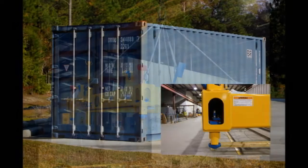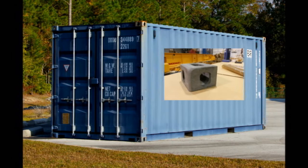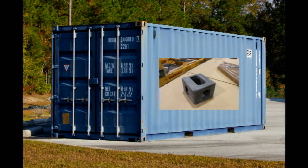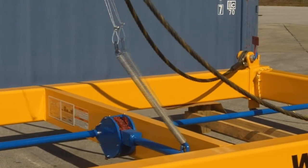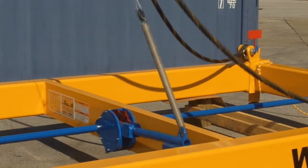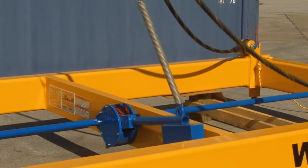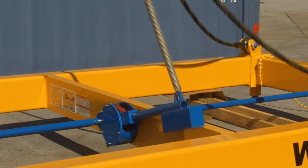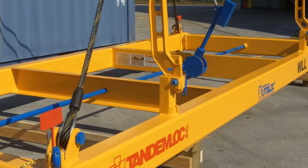In each of the four corners of the frame are twist-lock bayonets. The bayonets are designed to fit into the corner fittings as you can see at the top of our container. This is a corner fitting, and this is the opening at the very top — the spreader bayonets are designed to fit into and twist-lock inside of the corner fitting. All four bayonets are linked together and turned simultaneously each time the four-legged sling is slackened. This is the gearbox, which controls the locking and unlocking of the bayonets. Each time the weighted arm is raised and then lowered, the twist-lock bayonets alternate between lock and unlock. The gearbox is connected to the four-legged sling by the use of an activator sling. Only when there is no load on the sling will the twist-locks lock or unlock. Note the red flags at each corner — these indicator flags are directly connected to the bayonets, showing the crane operator their position.